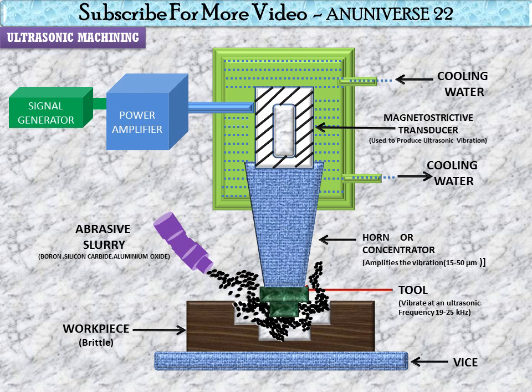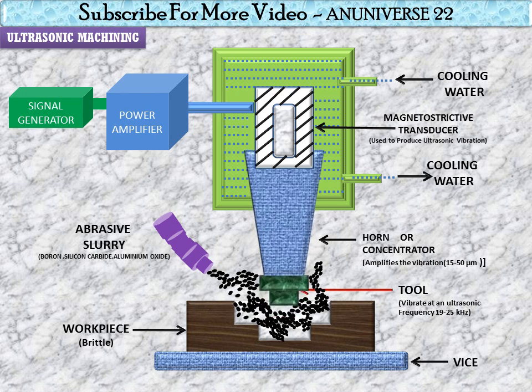There is oscillation motion on the tool. When the magnetostrictive transducer produces vibration, the abrasive slurry is pumped through the nozzle close to the tool-workpiece interface at a rate of 25 liters per minute. A static pressure is applied at the tool-workpiece interface to maintain the abrasive slurry.